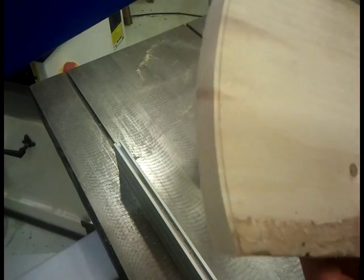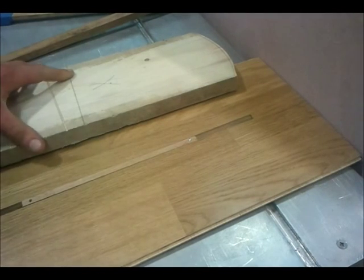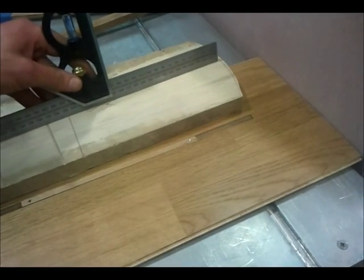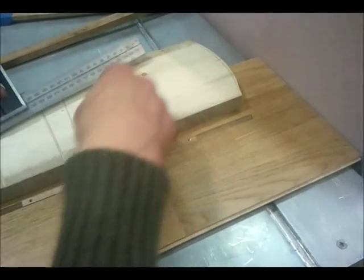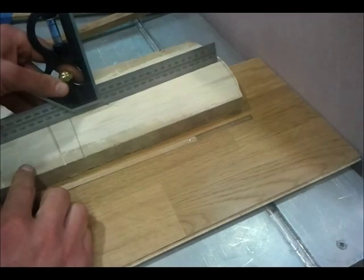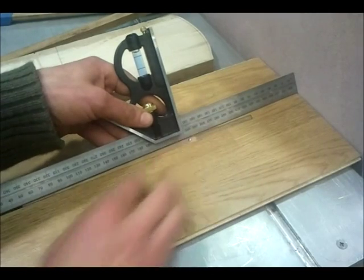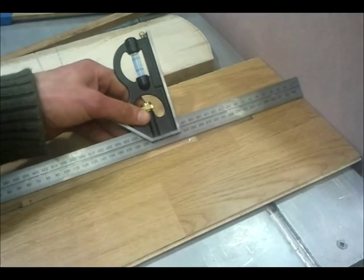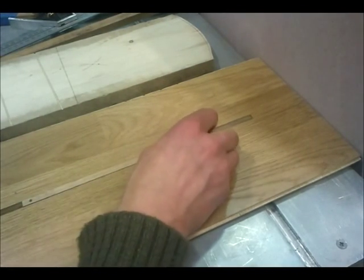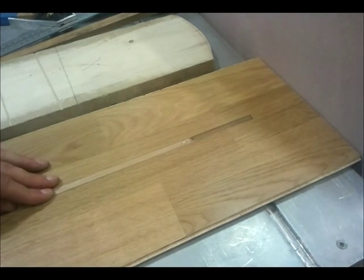So I went quite roughly just to the outside edge of that line, and then we'll go to the edge now. There are two ways of doing this. I can either measure it — if I wanted an exact distance to make that a precise sort of edge arch, then I'd measure that, transfer that radius, adjust, tighten it up, lock it in place, and then start that way. Or what I'll do in this case is leave that as a slightly loose sliding fit.